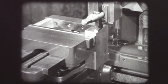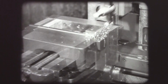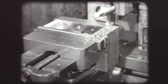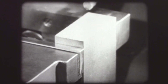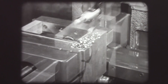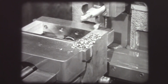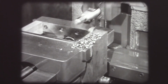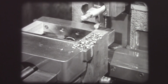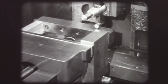The piece of wood at the other end of the vise must be of the same length as the block being machined. This wooden piece balances the pull of the vise jaws on the work. The rough cut on the first end is completed and the work reversed. With completion of the cut on the second end, the block has been roughed all over.